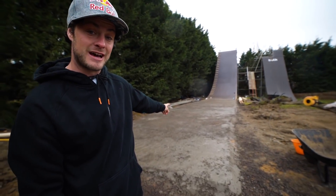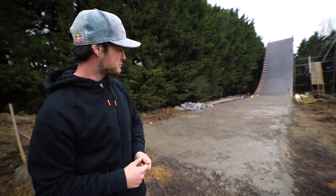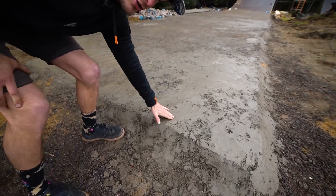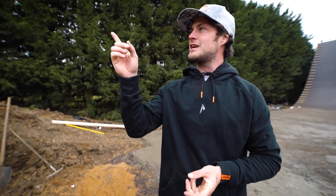It's really raining. It's going to be interesting to see if that gets slippery when it's wet. I tried to go with quite a rough tamp finish rather than a trowel finish, which my friend Justin suggested, because if it was all perfectly smooth and troweled - like already that's getting wet - you can feel that it's slippery, which I'm not into.